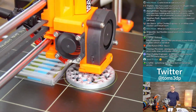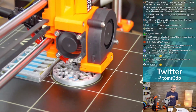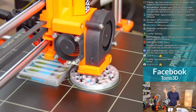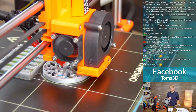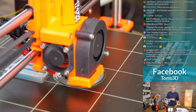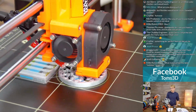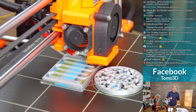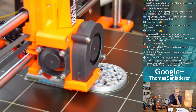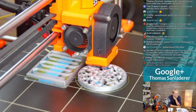One of the best choices there, I think, is still black ABS, because the black colorant absorbs UV light, so UV light is not going to penetrate deeply into your part. It might degrade the first 1 or 2 microns of your part. I don't know how deep exactly it's going to penetrate into a carbon black colored ABS, but not deeply. I've had a part outside in direct sunlight for 3, 4, 5 years, I think, and it still feels good as new on the surface. Just standard black ESUN ABS. So that's not an issue. ABS is also chemically very resistant, and it doesn't really care about heat too much. So black ABS, probably a good choice. ASA maybe as well, as it is less UV sensitive.